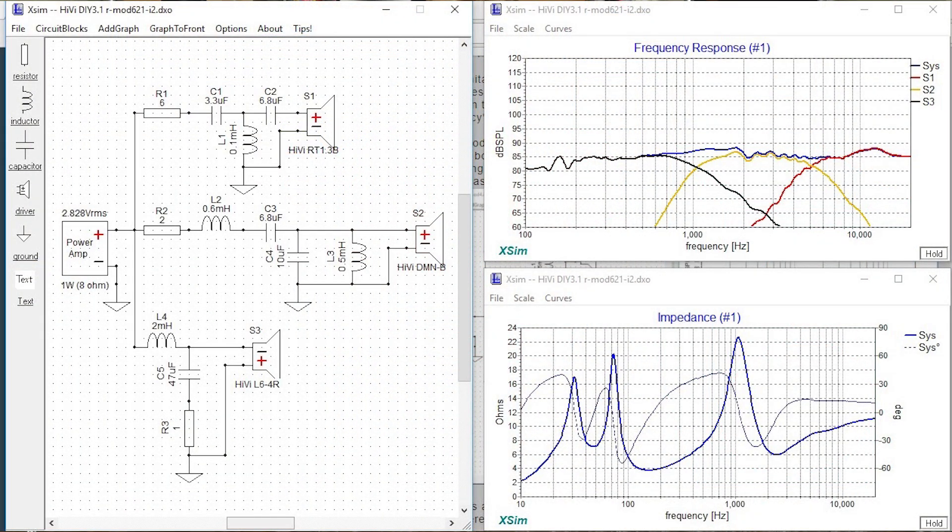And in the woofer crossover, instead of a one-ohm it's got a two-ohm. I think mainly what they were trying to do was just tamp down the tweeter a little. So I listened to the stock one and the modified crossover — he was right. The stock one is a little too hot on the top end. So I would highly recommend replacing those resistors with the ones recommended at that site as an upgrade.